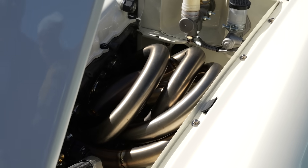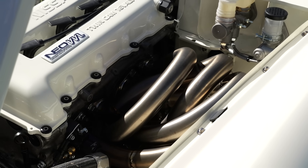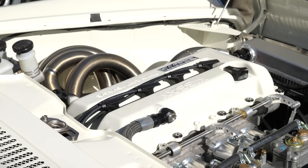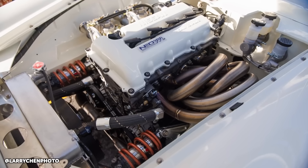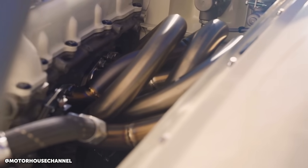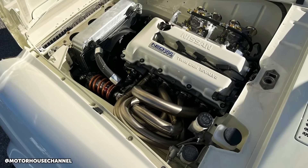One of the standout parts in the engine bay is the exhaust manifold — an interesting material choice. I wanted to do what the old Japanese chopper guys do, which is flame-bent titanium, and I really wanted a crazy sounding header so I tried to pack as much tube in there as I could — 16 feet of flame-bent titanium. I'm also interested to see how it holds up over time, because titanium isn't really a typical exhaust manifold material. It's a pretty light use application, not a heavy race application, and I have customers who want titanium for things like wastegate dumps, so it's partly a test to see how it works out.